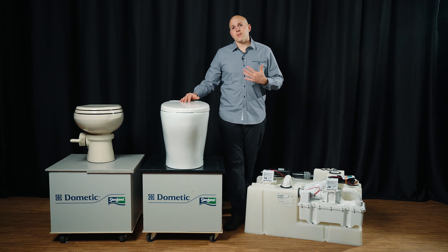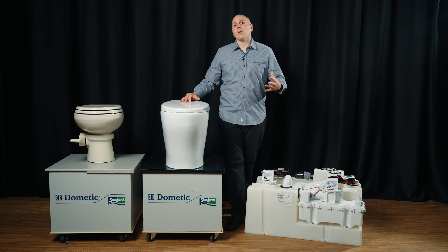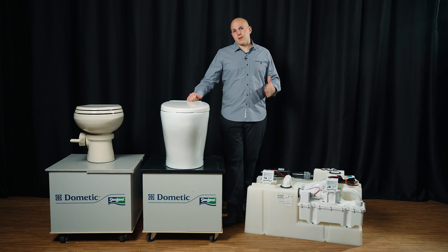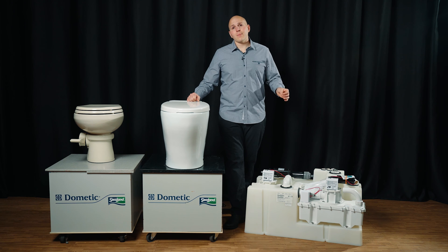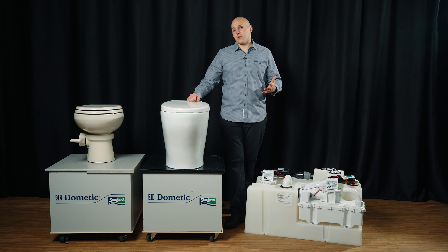A VacuFlush system is only sold through the dealer distributor network. If you're unsure, you can visit Dometic's website or give me a call and I'll help you find your nearest certified dealer. There are a couple of quirks when you install a VacuFlush system, and we usually don't recommend VacuFlush for public use. You can flush with as little as 16 ounces of water, and you're only pulling six amps for about 20 seconds — way less power consumption than charging your smart device.